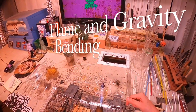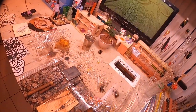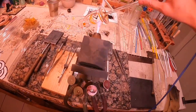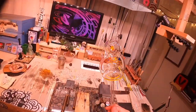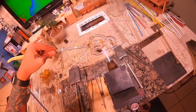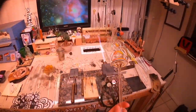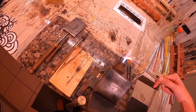Now here's using flame and gravity to bend the glass however you want it. Same way I showed you before — I quarter it in halves. I'm using the heat on the top part of the arm and just letting it drag down using gravity, holding it toward me. Make sure it doesn't get crazy — you want it fluid hot, so keep puffing with the heat and get a puff or two until it's all equal. It's practice — I tried this in the beginning and it was a nightmare, but using gravity this way lets you control the swing of the arm.